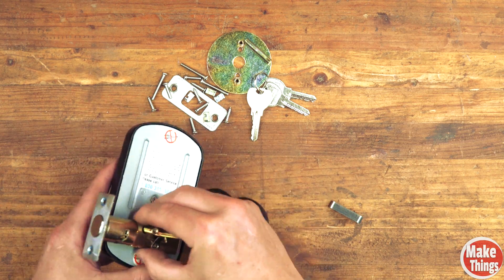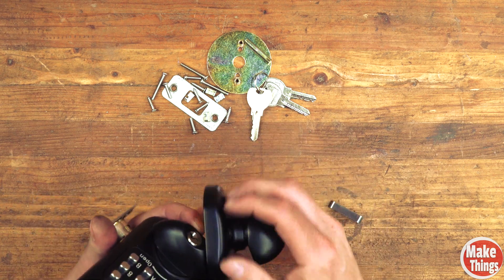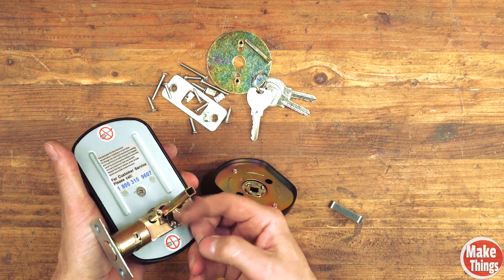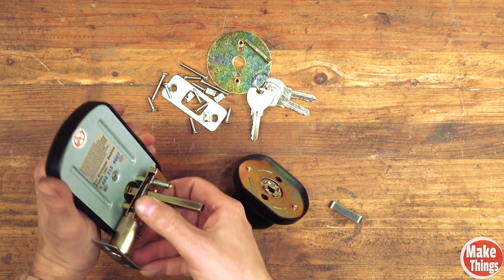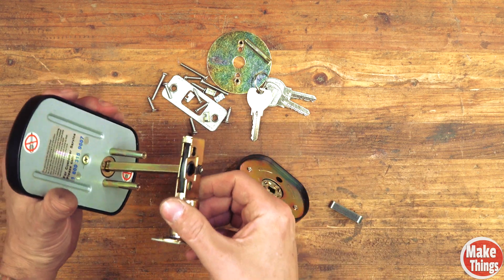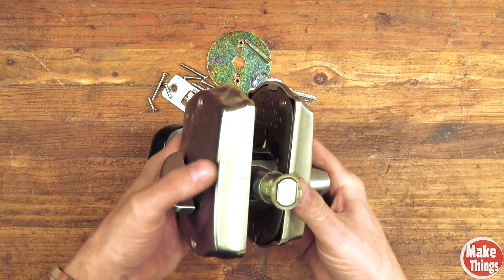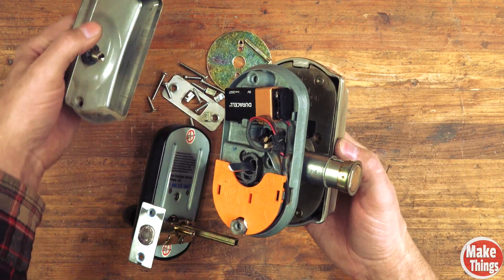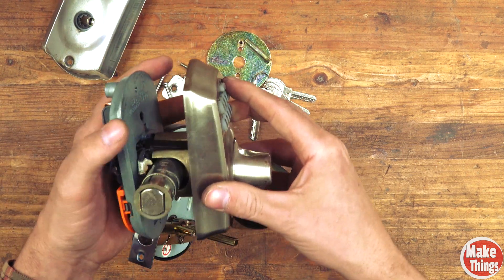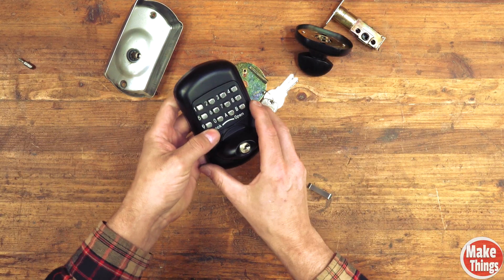Altogether there are really three main parts to this: the front of the door lock, the back that unlocks and locks it, and the actual bolt. There's a little tab right here and it's always going to face the inside of the door — it'll go either this way or that way — and that tab prevents it from going the opposite direction. If we look at my old door lock, you can see it's a much more complicated mess. I think this new lock is much simpler to figure out and put together. We're going to concentrate right now on this front faceplate.